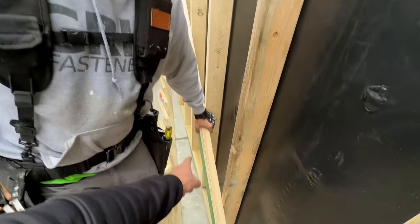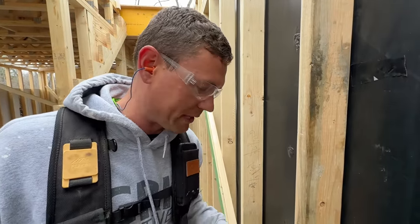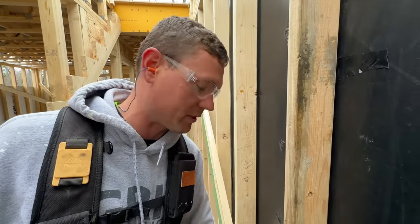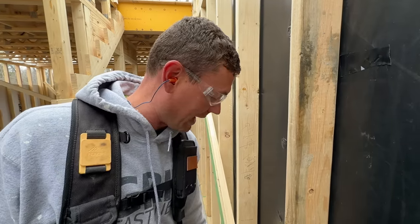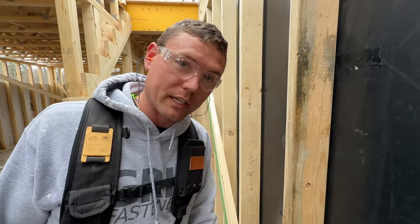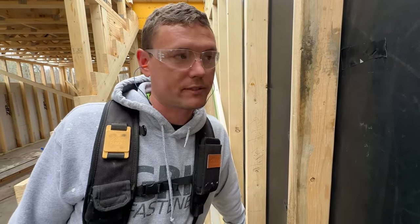What's the reason for this half inch you're adding? Well, our drywall is 5/8 thick, and typically we want to leave a space for the skirt board and the drywall, and it's always tight with an inch and a half. So with 5/8 drywall, we're losing an extra eighth in that space, and there's no way our skirt board is going to slide down in there. So we're going to have a little bit of extra room on this. That'd be nice. About an extra eighth. Now, it really doesn't matter that we have extra space, because the tread and the riser just hang off a little bit. It's all good. It really doesn't matter.